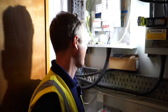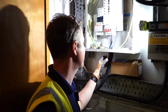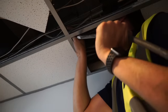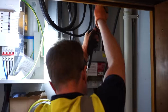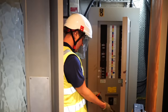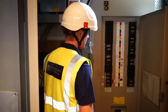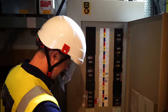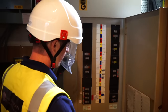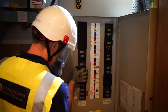We've got permission for the shutdown now. I'm just going to turn off all these MCCBs one by one to make sure that when we turn the main switch off we're doing it with no load. I've taken a photo in advance so I know which breakers were on and which were off — basically they're all on apart from the one we're going to connect to. Power is going off.